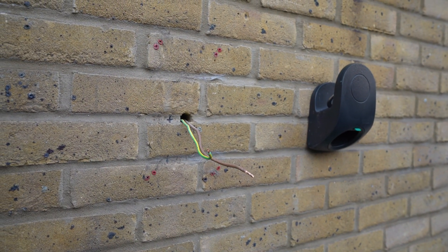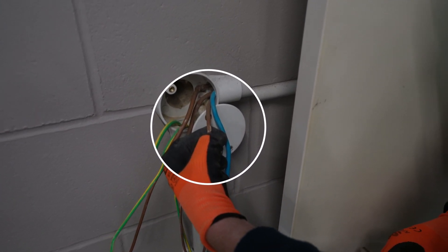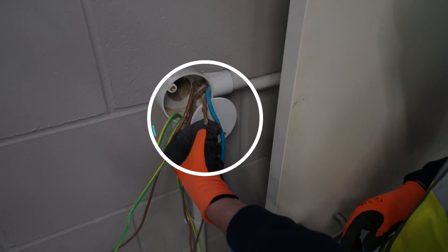At this point Stewart noticed a serious issue. One of the wires feeding the unit was frayed, caused by it being in constant contact with the sharp edge of the hole in the concrete wall — which is why wires should be protected by an additional insulation sleeve.